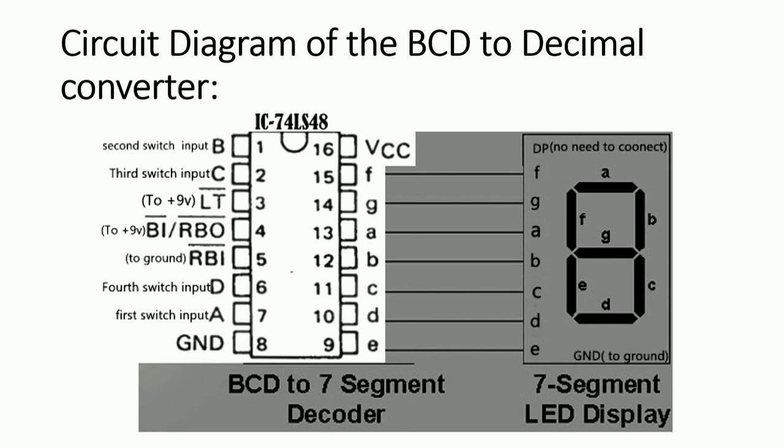There are also two pins left on the seven-segment display. GND will be connected to ground, that is the negative side of the battery. The DP pin — decimal point — will not be connected anywhere, because you only need to connect it if you want to use two displays. Since I used one display, I don't need to connect it.